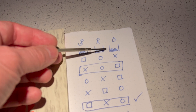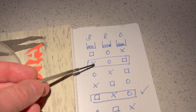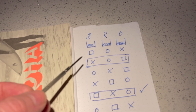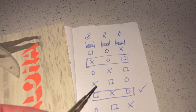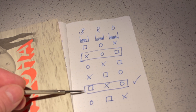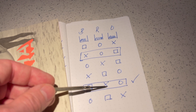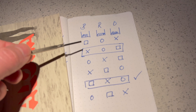And that was quite a bit of a challenge. We have basically three cable ports on the logic board — brown, red, and orange — because the red cables we have to re-solder are right below that. When googling it and looking at other servos, usually it is flipping the outer cables being the brown and the orange one. However, the e-flight servos have to be flipped in the middle and right positions — right being orange and red. So red and orange have to be flipped and we are fine.